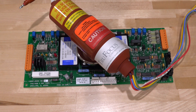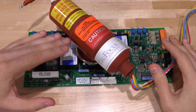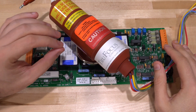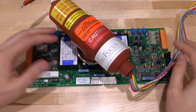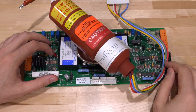A nice feature of this particular tube was that it could create a really small x-ray focus point, and that had a few advantages. First of all, it would create a nice illumination plane, and then you could elevate your sample and bring it closer to the opening of the x-ray tube and get magnification. Not to mention that the size of that spot will determine your ultimate resolution. So I could get really nice sharp images, and you could adjust that focusing by playing with some of the potentiometers in here, which would change the voltages and ultimately create the focus.